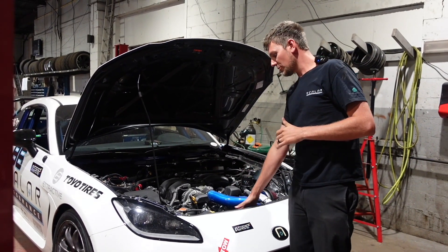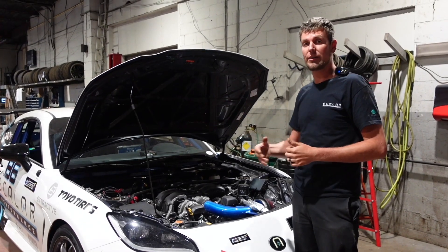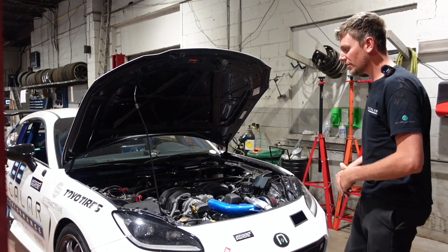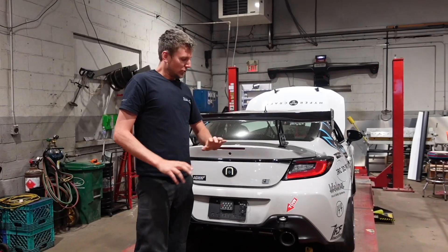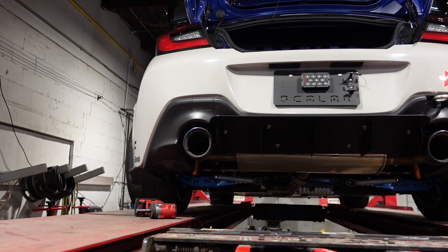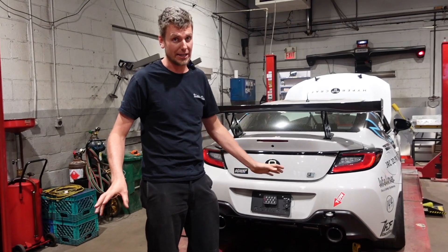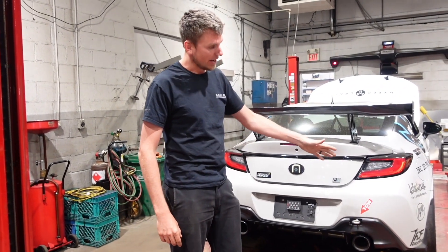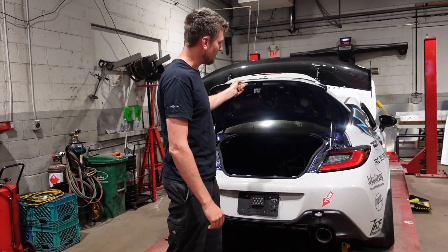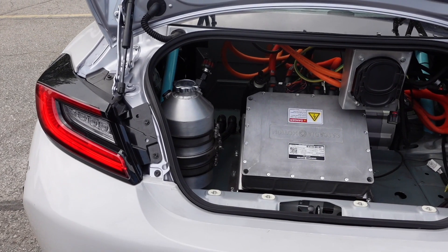You'll notice we're using a PWR radiator up front on both the gas and electric cars. On the electric, everything is already ducted up front, so we simply repurposed the radiator for cooling the battery and the inverter. At the back of the gas car, you'd have exhaust, a muffler, tail pipes, and a mid-pipe going around the subframe — we don't have any of that on the electric car. So we're free to do whatever we want back here. You'll notice our diffuser comes up really nice and high, tying into the flat-bottom car, which is the battery pack itself.